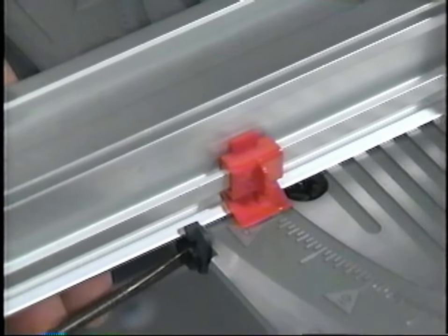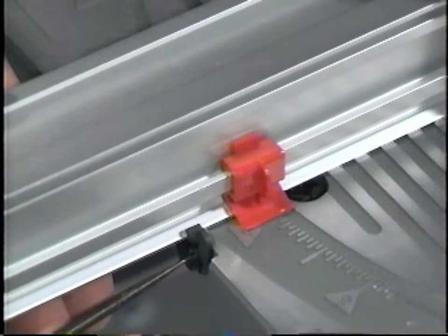Use a screwdriver to adjust the cam located at the quick stop. The angle indicator should be positioned precisely in the center of the 0 degree mark. Once the miter base is aligned parallel to the blade and the quick stop is set precisely at 0 degrees, you're ready to check and adjust the miter table and fence.